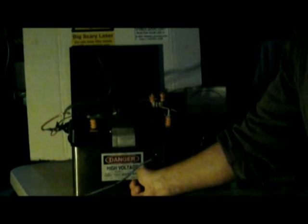If I draw it to the left side, you might be able to see that. Now we're going to increase the current from 2.6 to about 3 amps. As I draw the core out, we increase it: 2.6, 2.7, 2.77, 2.8, 2.9 — that's about 3 amps.